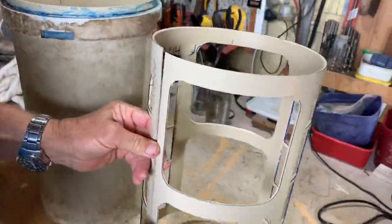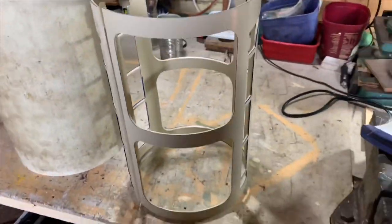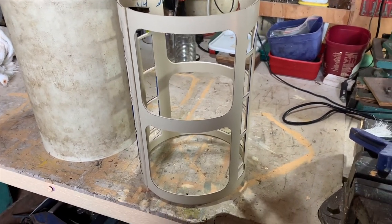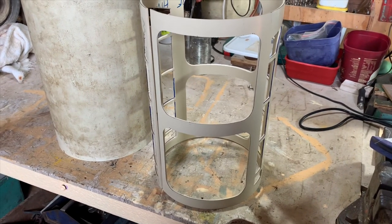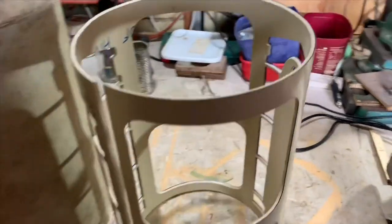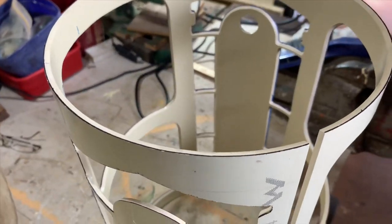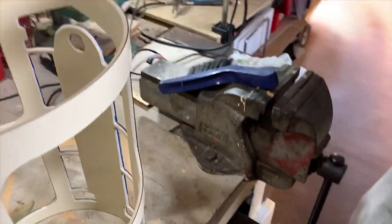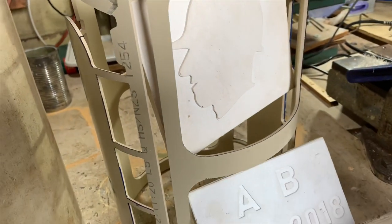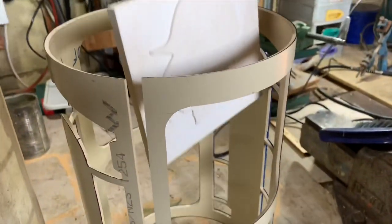John shows the panels and notes one is a secret. When asked how he cut them out, he explains it's done very carefully with a jigsaw — hours and hours of labor. You have to keep working at it with a fine jigsaw, maintaining all the right angles. It has to have a relief angle otherwise it won't clear, and the pieces will sit inside one another. Hopefully it'll produce a really nice image.